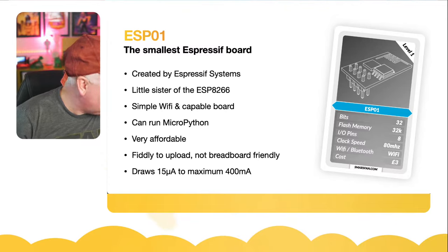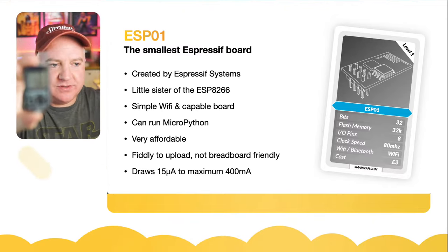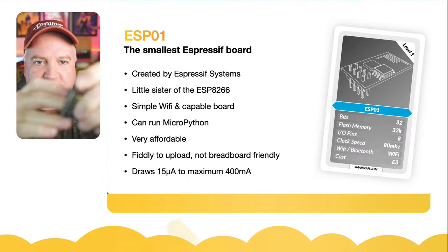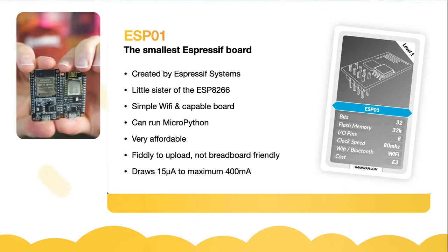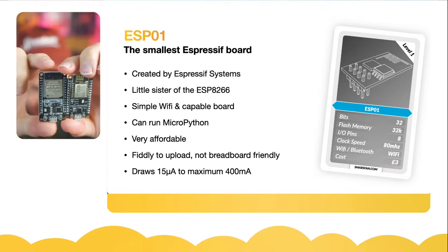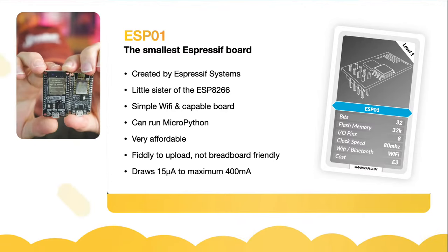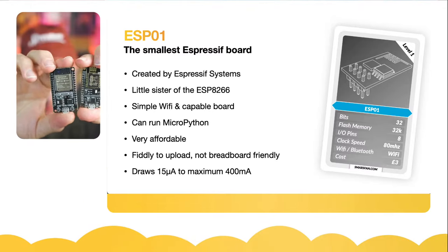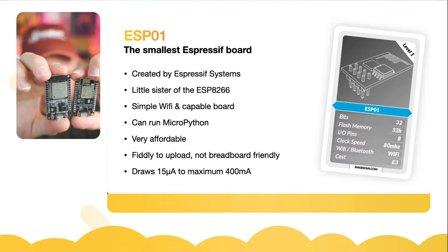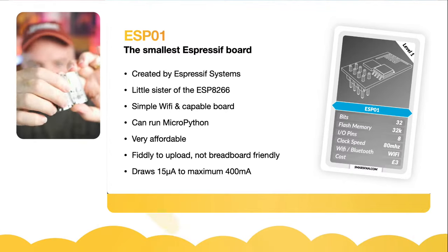I'm just going to show you the ESP32 first. I forgot to show you that. So the ESP32 compared to the NodeMCU, they almost look identical. The ESP32 is slightly larger. You can see it's this one here. It doesn't have that wiggly line as the antenna. It's hidden away under that board. And it has a Bluetooth chip on it as well. So it's quite a bit bigger in footprint and height as well, I think.